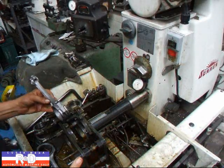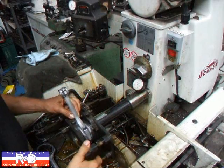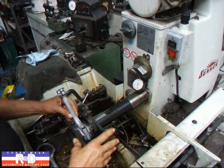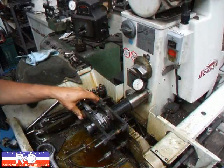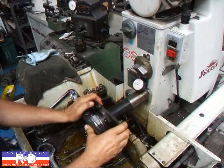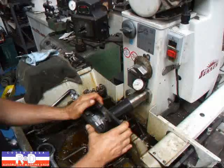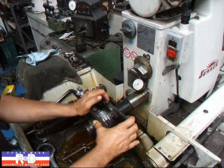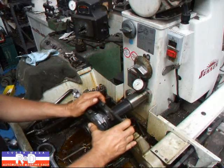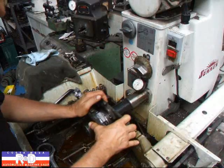We've got a special fixture on the machine, which is an option when you buy the machine, but it works out really well. Make sure that you keep the bore 90 degrees through the hole when you hone this thing out — that's really important. You have to stroke the rod back and forth, and as you do so, the stone inside automatically tees up.